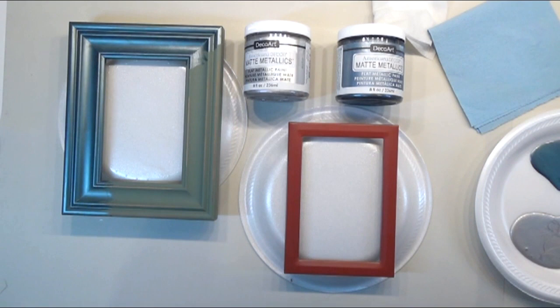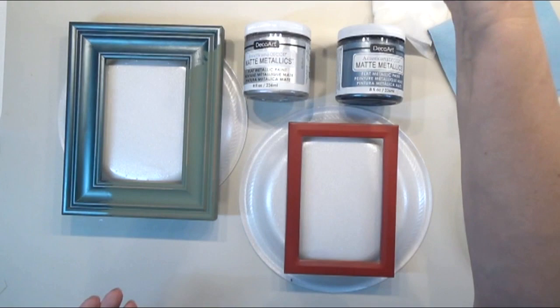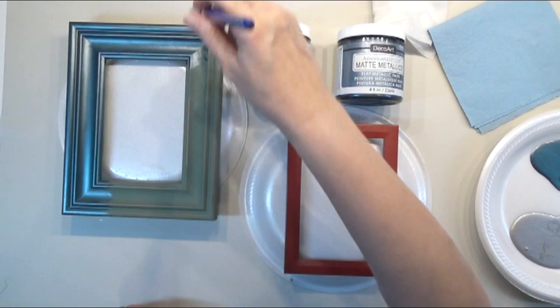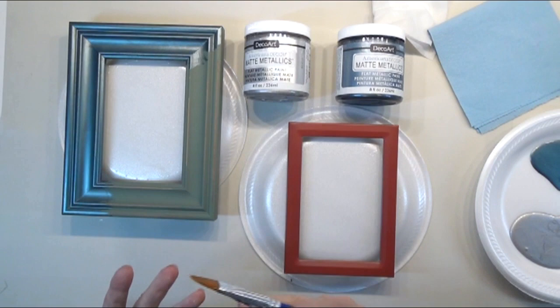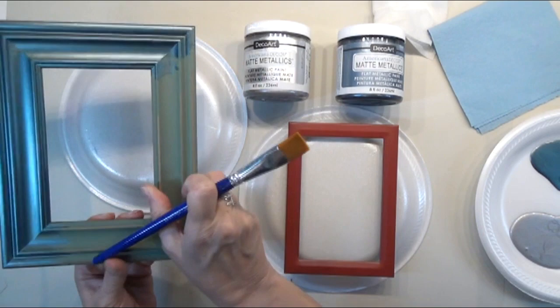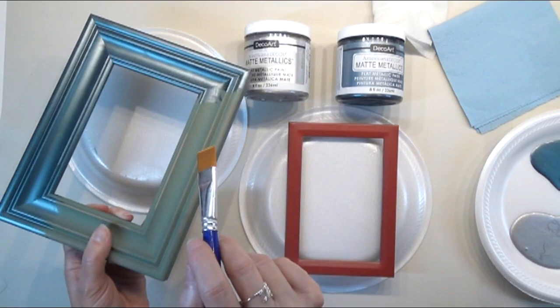You're going to want a brush that will work well for the size that you use. When you apply this paint, you're going to apply it in a continuous stroke. The stroking movement that you start with is the one that you want to end with. You don't want to come back and pit-pat and go this direction if you started that direction. You want to go the direction that you start with. Just a nice fluid movement will get a nice coat on there. You don't want to go over it too many times because you could start lifting it. So I'm going to finish this frame out — this is only one coat on here. Look at that.